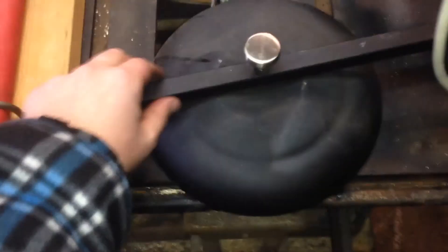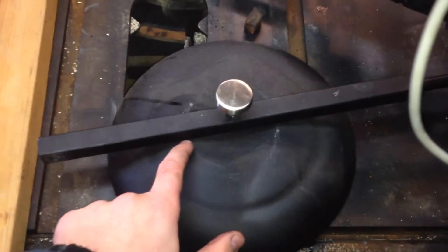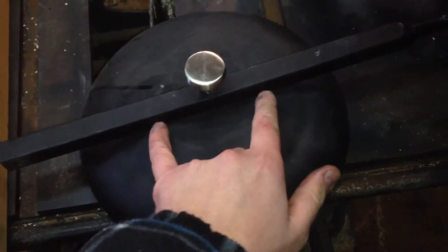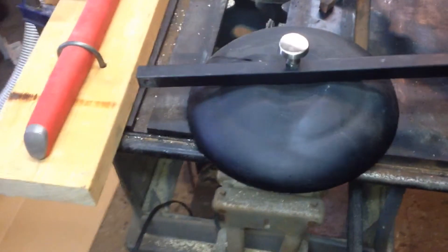And when you're done — this is another big thing. If you have a square tubing handle on the lid, do not weld it at multiple points around the perimeter because you're going to get flex and this thing likes to fold up on you, and then you're going to have leaks again. The only way you want to weld it is by the nut or screw that's inside. If you weld at multiple spots, you're going to get warping, and then it's a pain.